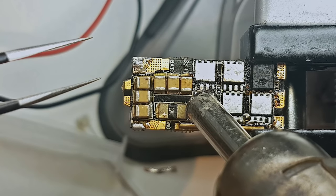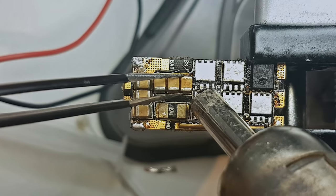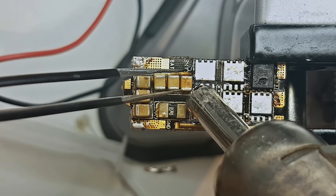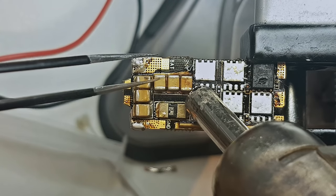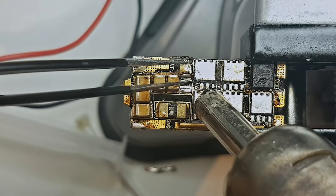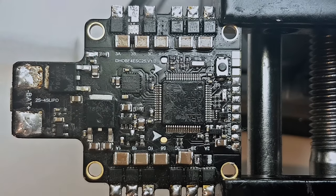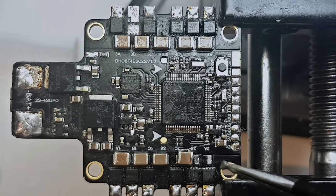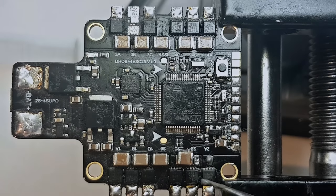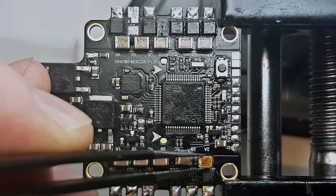I will have to wait a bit because the board has a lot of copper and it takes a while until it gets to the right temperature to melt the solder. Now it's getting close, but not quite there yet. Okay, so we found ourselves a cap, and to solder it in place I will use some solder paste.